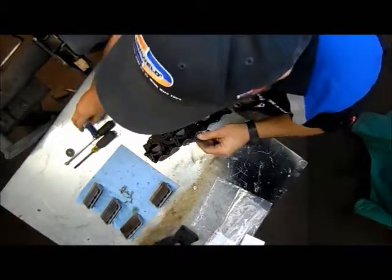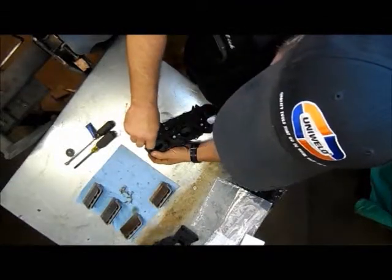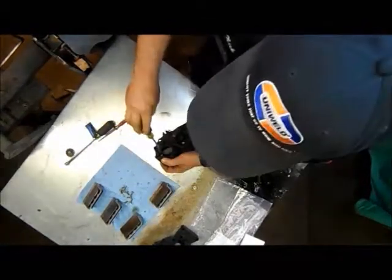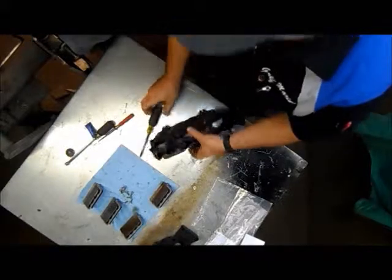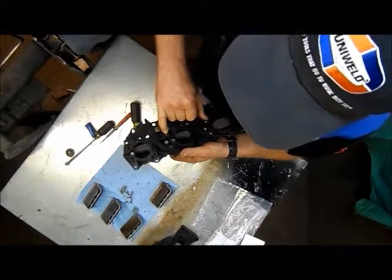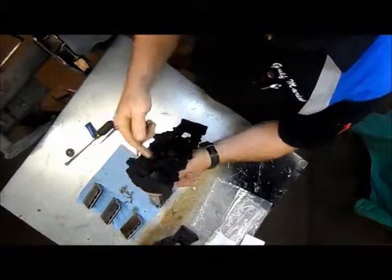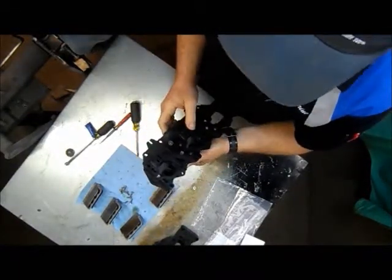Okay, I'm not gonna bore you guys with the details of getting all this together. It's pretty self-explanatory. Once you got one in there, and you see how we put one in there, then you know how it goes. One thing I will touch on is, and I've already tested these, these are check valves. They allow for a one directional flow of oil that ends up puddling down in there, and it allows the oil to travel back into the motor and not out this way.